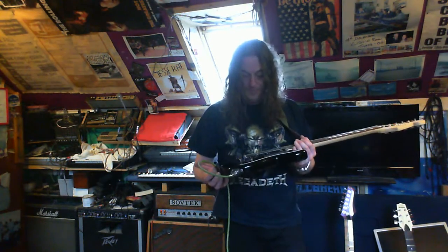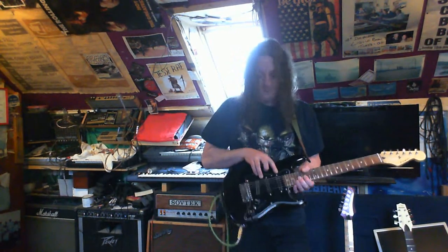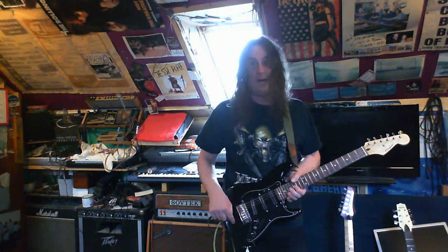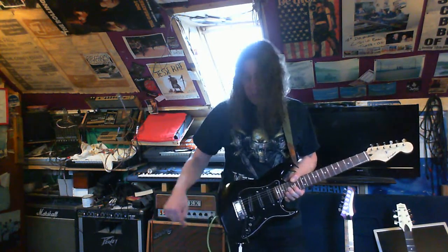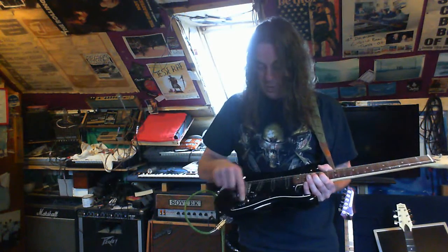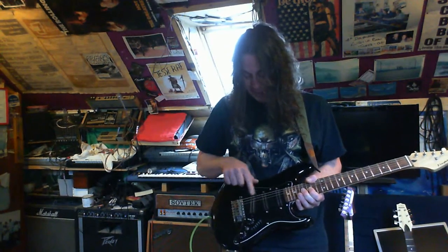So Brian May's guitar has 3 trisonic pickups, each with an on-off switch and each with a phase switch, and they're all wired in series. So this one I didn't have enough room to put the 6 switches 3 in a round, so I've got them all in one line. So the first 3 switches turn the pickups on.